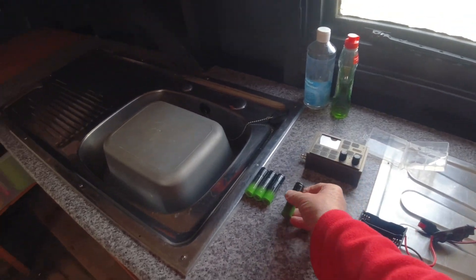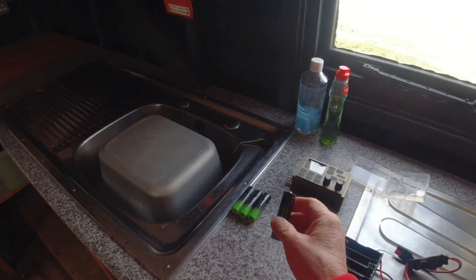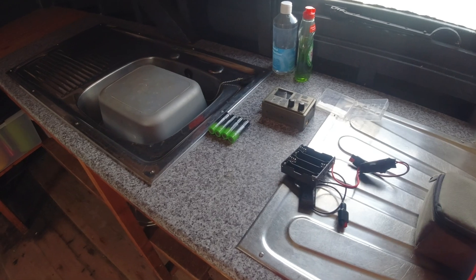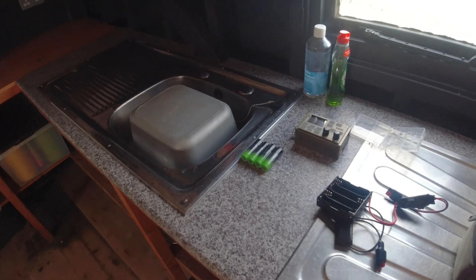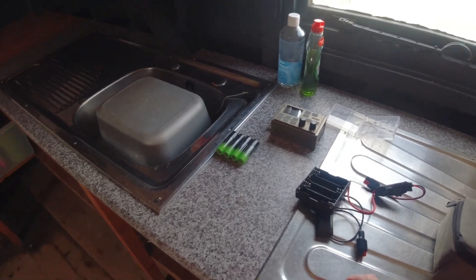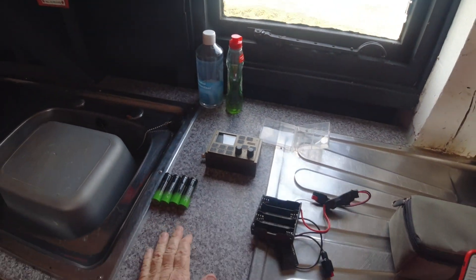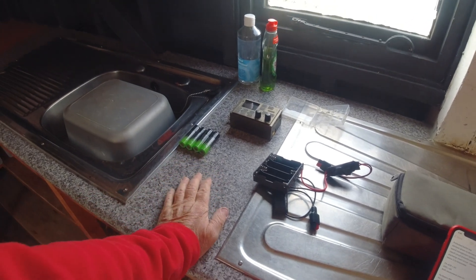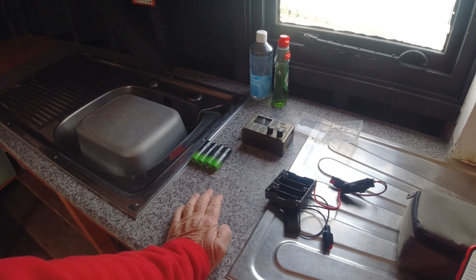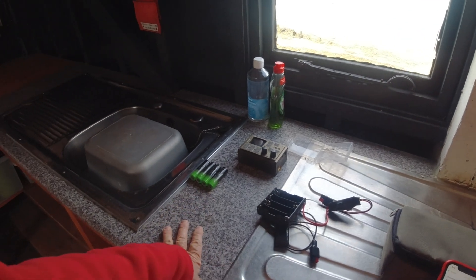There are different types of these batteries - you get some with a protected button top, which has circuitry inside that prevents overcharge, over-discharge, short circuit, and overheating. If they go below about 2.5 volts they're effectively dead and irreparable. I've been looking for a more reliable source and found two places: one called New Battery and another called Fogstar.